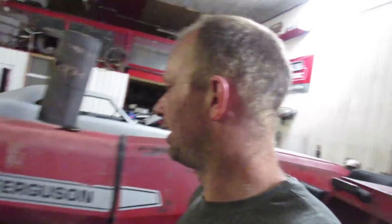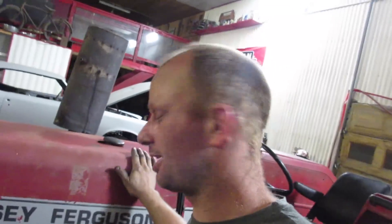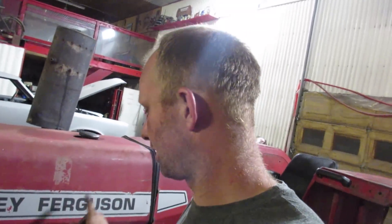So I say they're easy to work on, except kind of the engine. The hood is a pain in the ass and they put the fuel tank over top of the valve cover. The oil pan is actually structural, so I've got to crack the bolts loose on the front and then take these bolts off underneath here for the oil pan, and then just kind of tilt the engine forward and drop the pan.